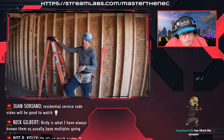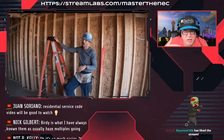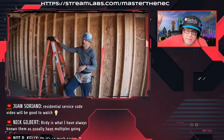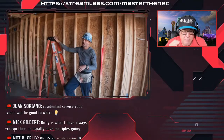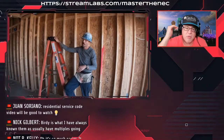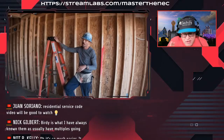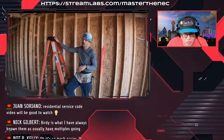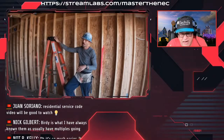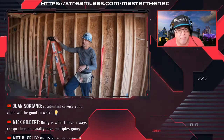So if there's a clamp in a box, or even an internal clamp that's built into it that holds the cable in place, then you can go up to 12 inches for that first staple, and then you can go up to 4.5 feet. Other thing I'll mention is that a lot of people think that when you go up above the ceiling and run it across the top of those trusses or ceiling rafters, you don't have to secure it every 4.5 feet. That is not true. Even though it's theoretically supported, it still has to be secured every 4.5 feet. So all of that's in 334.30. Check it out, and you'll get a better understanding.